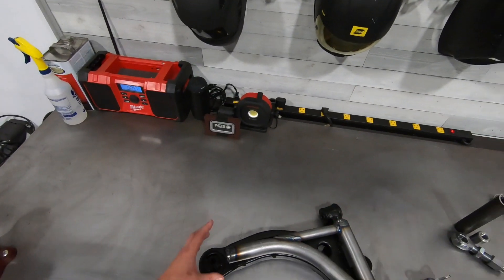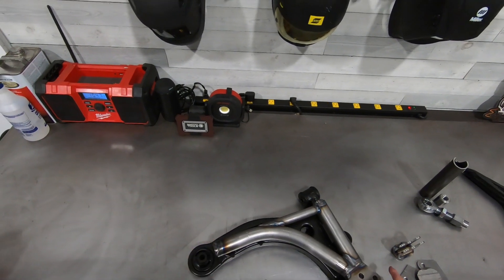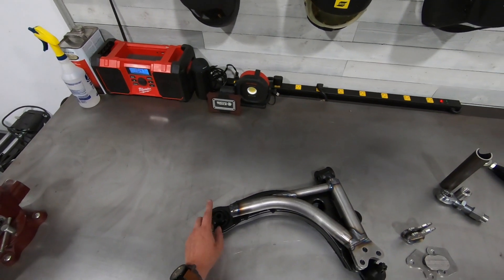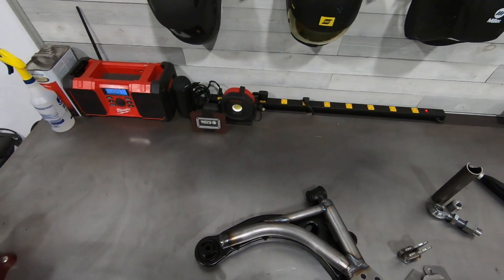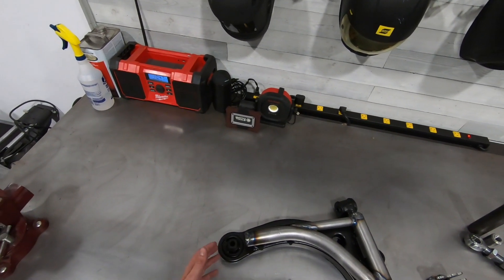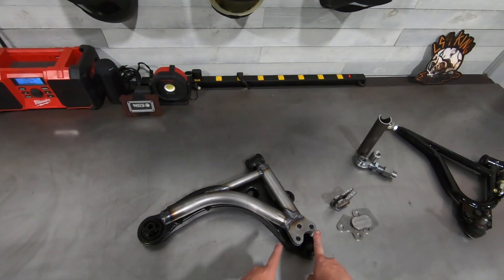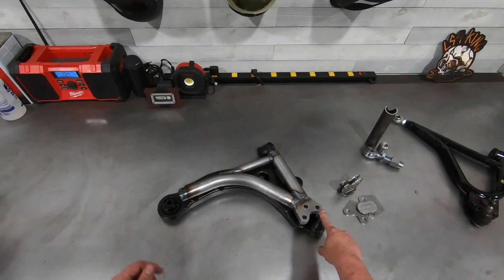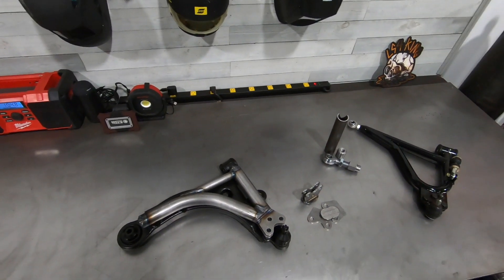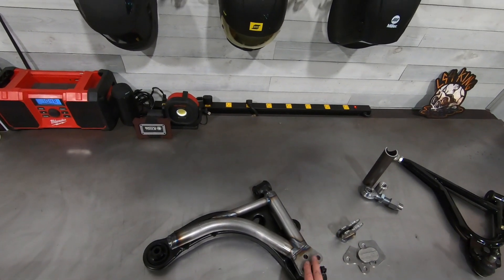This is laid on top of a factory OEM stamped steel control arm. W body control arms have one horizontal and one vertical bushing — this is a common failure point. A lot of people upgrade to the Mevo Techs that have a better bushing design, but ultimately we still see failures. The bolt-in ball joint is actually riveted from the factory. Anytime you service your car and don't want to replace the entire assembly, you have to drill out those rivets. These ball joints are serviceable and used in a bolt-in configuration.